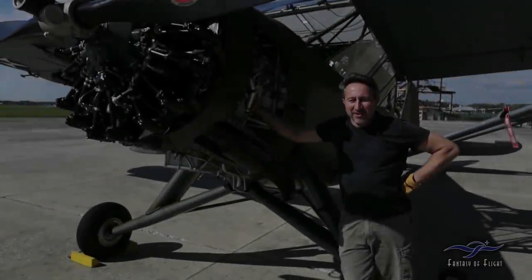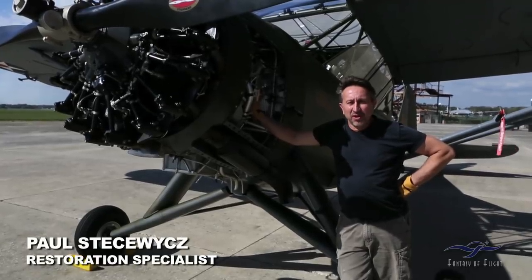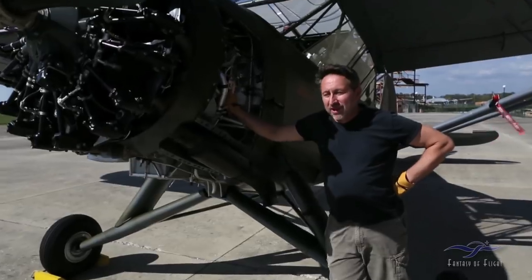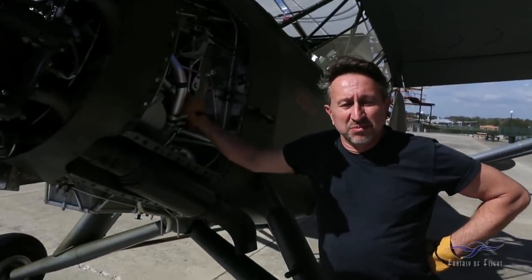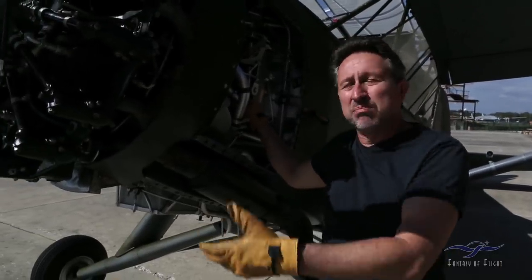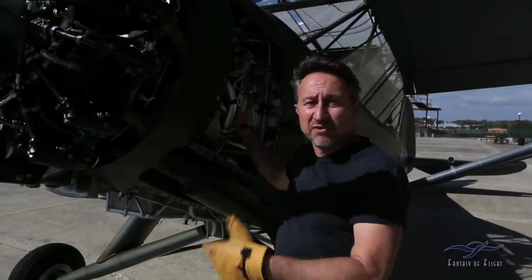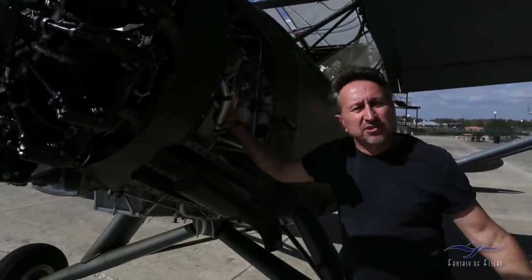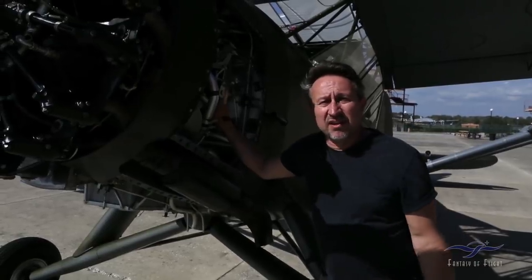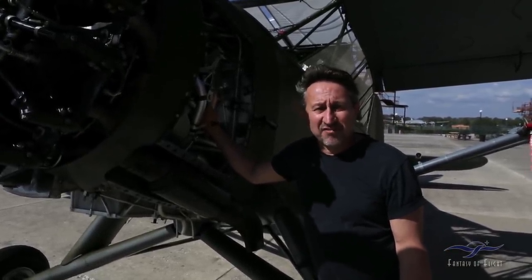As we all know, the L-1 had a major catastrophe a number of months ago. Like all radial engines that sit for a long time, they collect oil in the bottom cylinders. As a precaution to avoid any damage, we pull the bottom plugs, we drain that excess oil, we pull the prop through, sometimes we even spin the starter through to make sure it's clear. We did all that, went to start it, and guess what? It got oil in it, and we bent rod number 5.